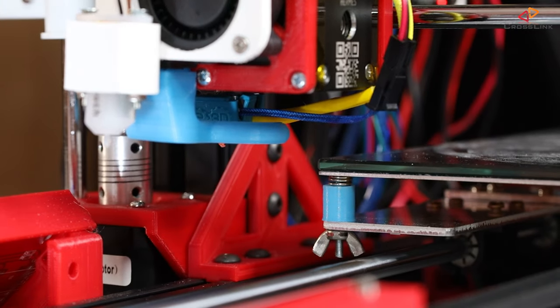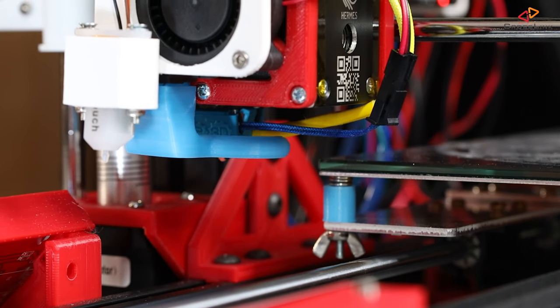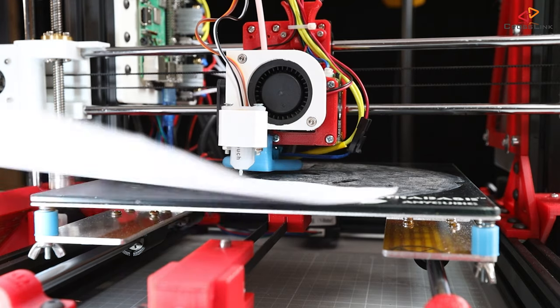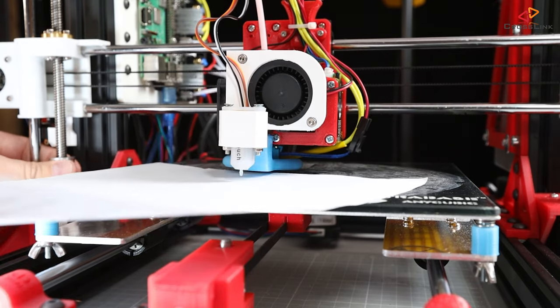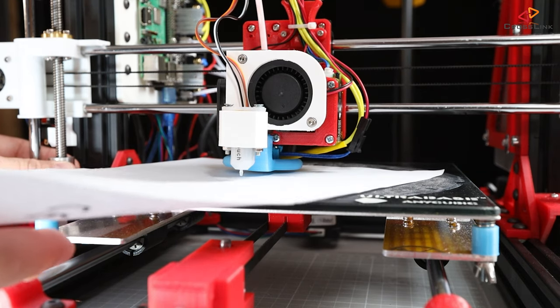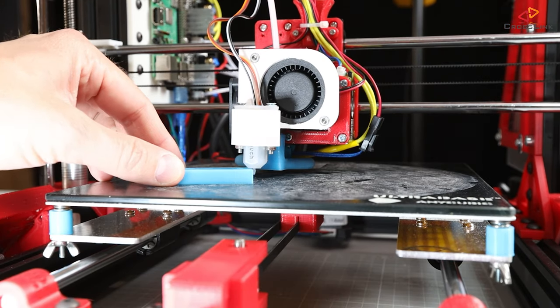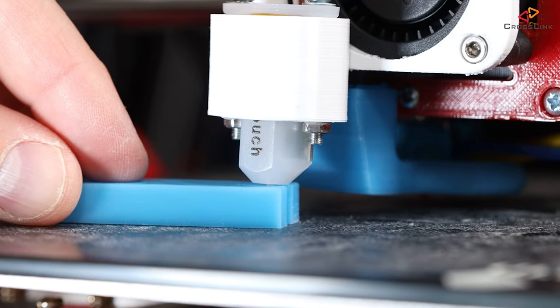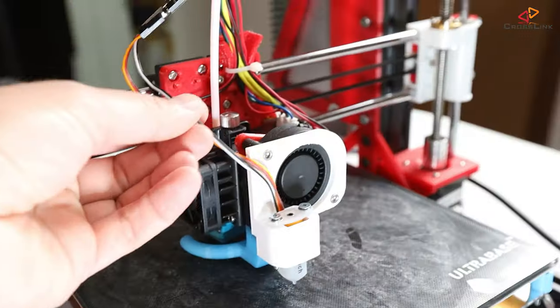So how is the gauge used? First, bring down the nozzle to the print bed — if you can still auto-home on your printer, use the auto-home function for that. The alternative is to bring down the nozzle using the Z-motors until it touches the bed, and you might want to put a piece of paper in between nozzle and bed, because that is the distance we're going for later in the final calibration. Then pushing the gauge underneath the BLtouch should leave no gap — it should really touch the BLtouch housing and sit there quite firmly.